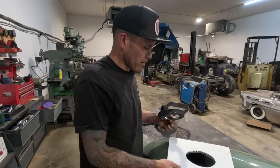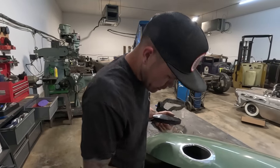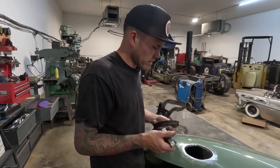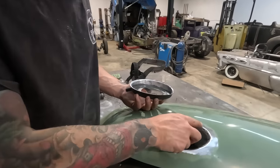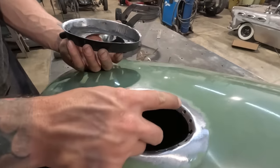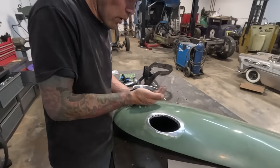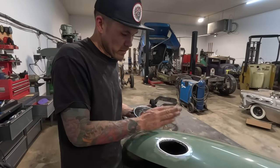Okay, so where we're at right now is I'm noticing a little bit of slippage with this tool. As we're bending it over, it's kind of slipping a little bit. So perhaps it could be a little bit deeper, but basically right now, this edge is a little bit too soft. So that edge is gonna need to be crisped up to move this flange a little bit wider. And so what we're gonna do is probably use hammer and dolly to try and move a little bit more